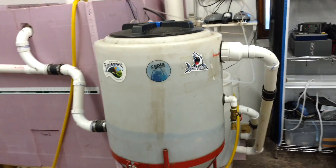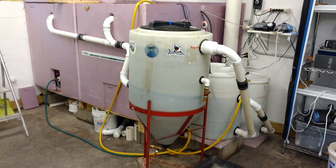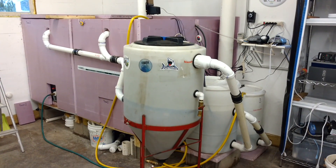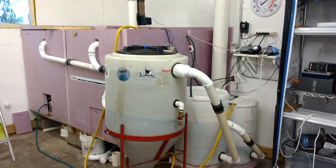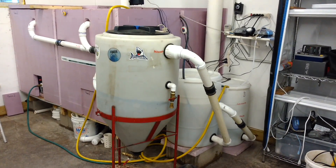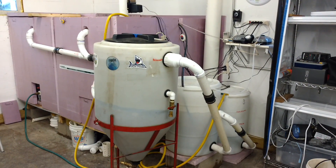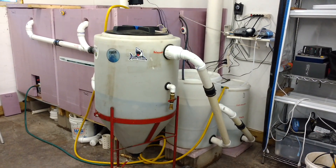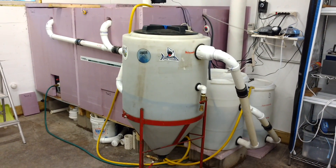So that's the final configuration for the winter. Now I have an indoor insulated filter, and I'm just going to finalize the plumbing now that I know how I want the tanks to go in sequence. I really struggled with that Saturday because I have such different drain rates — I could never balance the system. So I had to go to a sump tank with a float switch that turns itself on and off periodically, because the slow sand filter drain is much slower than the recirculating overflow drains. But this stayed balanced really well during the night, so now I'll put in some permanent plumbing to get the tanks all hooked up. That's the update from the fish farm.